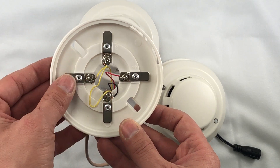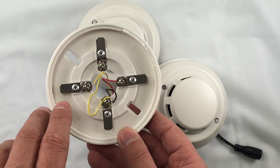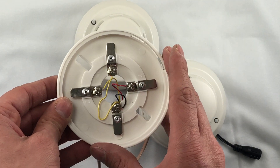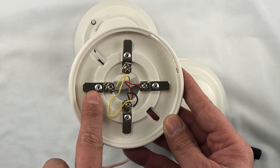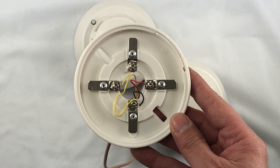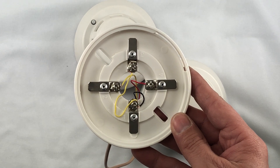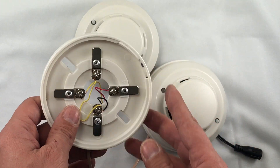So the wiring — you just have three wires that go between all your smoke detectors. If you do connect this to your alarm system as well, your alarm system has to be powering these. You would take the interlink wire, which is terminal 2, and run that wire back to your alarm to whatever zone you want it to be in. Put your resistor on it to trigger it, and that would be the wire that goes back to your alarm.